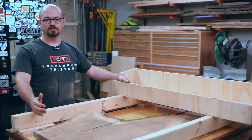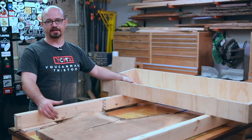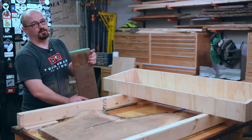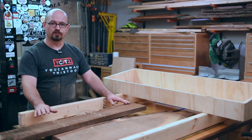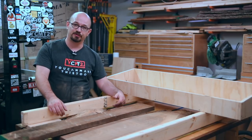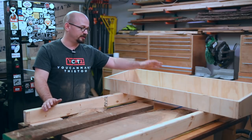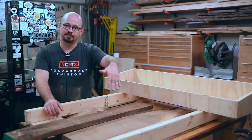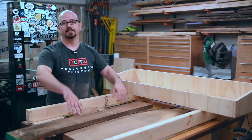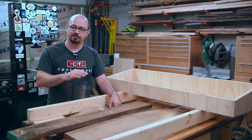The first substitution I'll talk about is the sled that I built, made to work with either a router or a circular saw. I did a whole build video on it that I'll link to. You've probably seen sleds like this used to flatten slabs, but there's no reason you can't use it to also flatten regular rough dimensional lumber — it works exactly the same way. You get the board inside the sled, shim it down, and use some hot glue to make sure it doesn't wobble. Then you get your circular saw or router inside the sled and pass it back and forth until you get one decent face. Once you have that face, put it down on a good flat surface and do the opposite side — now you have both sides planed and they should be parallel with an even thickness.